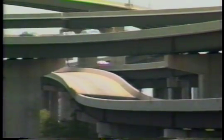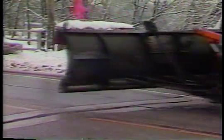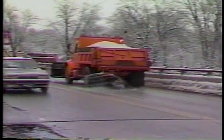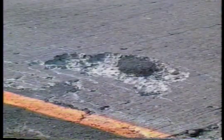More than half a million concrete bridges carry our nation's highways over watercourses, canyons, bays, and other roads and structures. A significant percentage of these have deteriorated, or will begin to deteriorate in the near future. Much of this deterioration is due to the action of de-icing salt, which penetrates the concrete cover and initiates corrosion of the reinforcing steel. The resulting rust causes the concrete to delaminate and spall, leading eventually to severe deterioration of the riding surface.